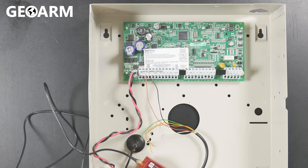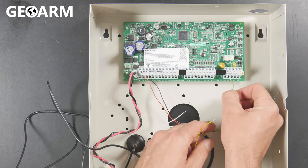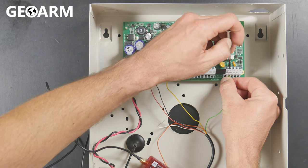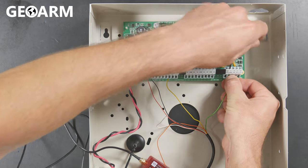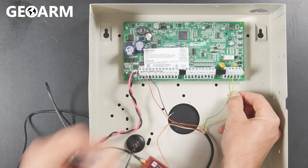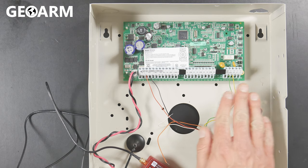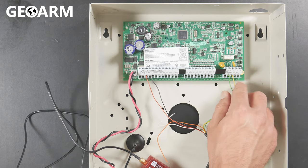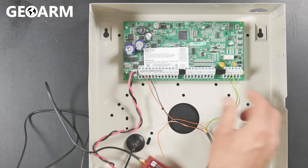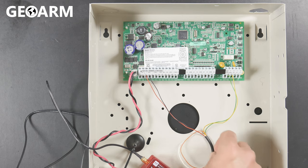Now we're going to go ahead and get the green and yellow wires wired in. Green is going to be for the ring, so you're going to take green and go into what's labeled 'ring' right here and get that screwed down. Now you're going to take the yellow wire and go into tip, which is located directly to the right of the terminal you just wired into — screw that down. There may have been wires in these terminals prior to installation; you want to make sure that there are no wires in A, B, C, or D. These should be the only two wires making connection down there. Now you have your connections for both power for this device and communications. This device is completely configured at this point for communications only, so those of you not using the interactive app are good to go.